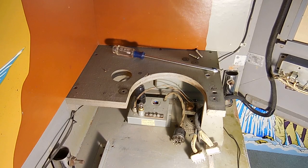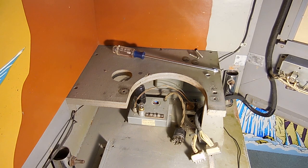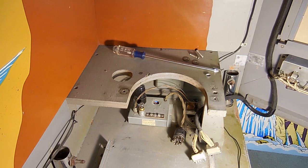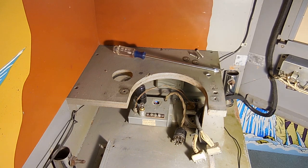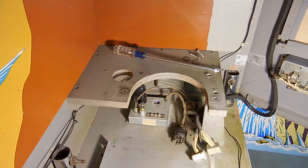This is the inside of the stand for Shoot the Bear. The amplifier would normally be right here in the foreground — a box in the back with a single tube. And what appears to be a light bulb is the growler. It makes the noise for the bear when it raises up, growls and goes back the other direction. It uses an amplifier tube, and that tube in the front is used to make an oscillating noise — it's basically a neon tube, and any neon tube could be used. I strongly recommend that you never touch that chassis or anything else, because it's got over three hundred volts DC on it when the game is being played.